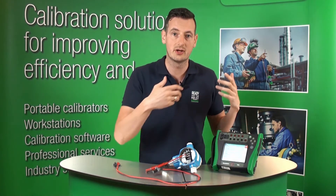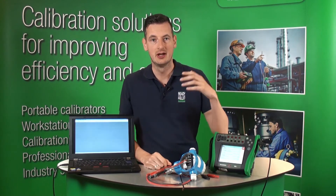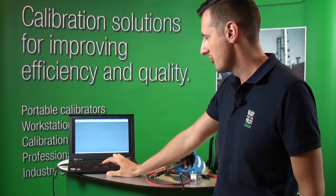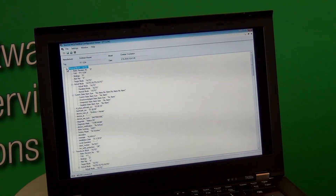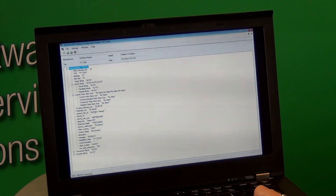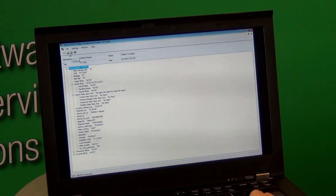These files could be stored here, or we could go and transfer that information to the PC. We have now connected the MC6 to the PC via USB. All you have to do is open the Configuration Viewer and click on the MC6 icon. These are the five saved configurations in the memory of the MC6. You choose the one you want to transfer to PC. As you can see, there are three blocks — the same as what we had on the MC6. If you open the physical block, this is exactly the same information as we saw on the MC6. You've got two options: you can either print it or save it to a file.